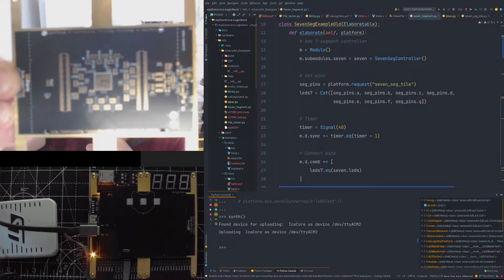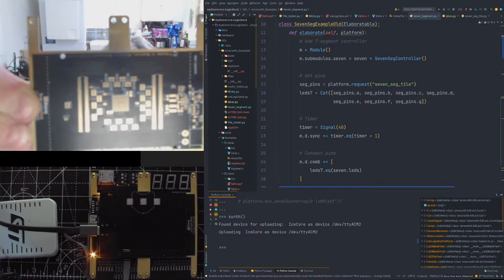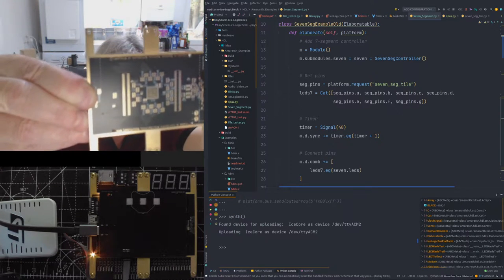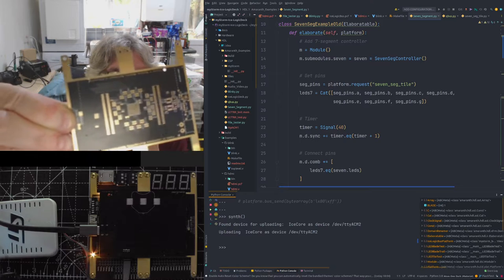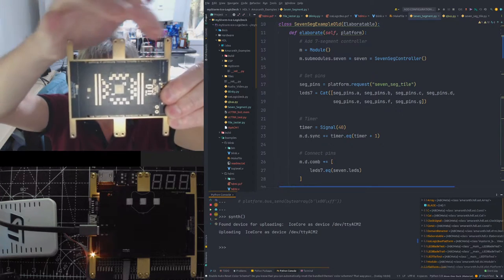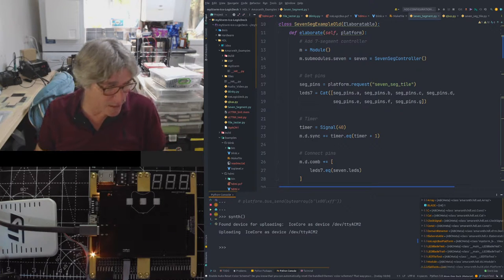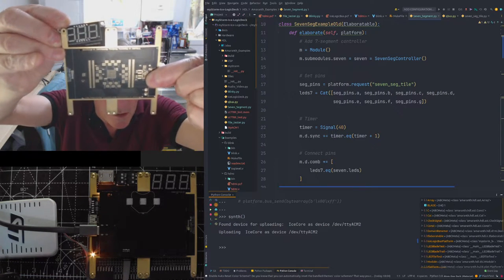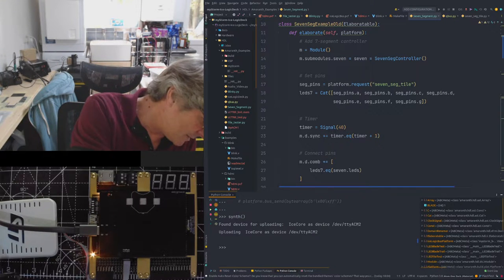So, yes, this side is where most of the components are: the FPGA, the serial line terminators, serial line impedance matching, and then the power supply over here, and the USB power delivery. And then you've got the two mezzanine connectors, one, two here. And the mezzanine sits on top of that, and then you've got these nice gold fingers, or prongs, as we've called them before, with the apertures in for the tile boards. The purpose of those is you can actually get a tile in between. So when the tile PCB goes on, it goes on like this. I know that's not level, but it peeps through, which is kind of cool, if you haven't seen that before.